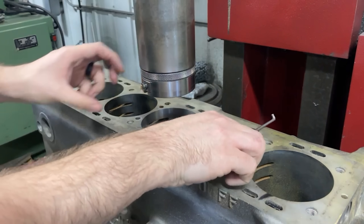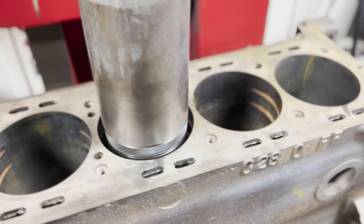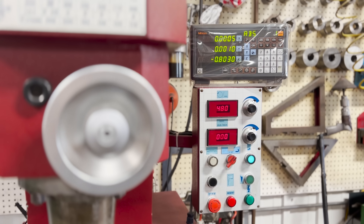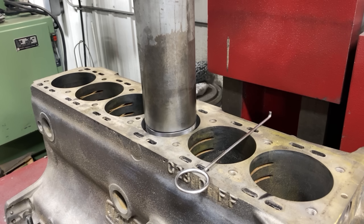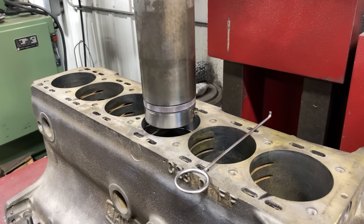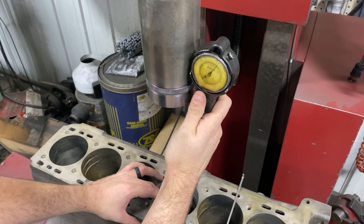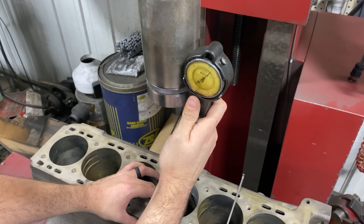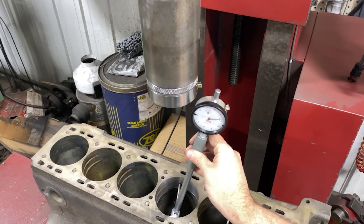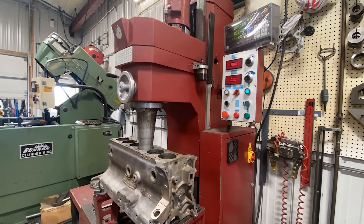Knowing that our upper cutter was set correctly, our lower cutter that is set approximately two thousandths smaller should give us approximately our desired two thousandths press fit, but again we're going to cut a bit and measure before boring the entire length of the cylinder. The cutter didn't touch the top portion which we already cut, which is a good sign, so we'll continue with the cut until the second water passage of the block. After stopping the machine to measure we again found that our cutter was doing exactly what we wanted, giving us a diameter that gave just over two thousandths press on the sleeve. The factory specs for this block listed a press fit of three to five thousandths which we believe is quite excessive. I double checked my measurements with a second bore gauge and I'm comfortable with the way that our cutters are set, so I continued forward with boring the entire length of the cylinder with our lower cutter.